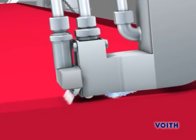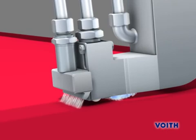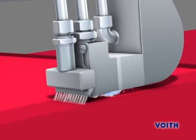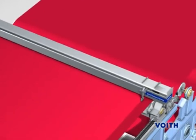Residual water which adheres to the fabric due to the cleaning operation is blown out by an air knife, that is compressed air which flows through several nozzles. The fabric is cleaned mainly in step cleaning mode.